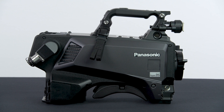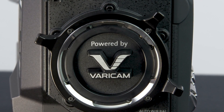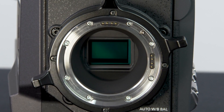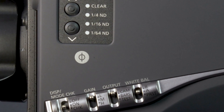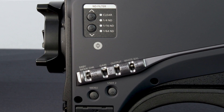It's basically plug-and-play. Starting in the front, we put on a PL mount with a Super 35 sensor. That is a 5.7K dual-native sensor. The dual-native will be active in the fall — right now it's 800 ISO, but we're expecting to have 800 and a targeted 2500. We also have servo ND filters, controlled remotely or locally at the camera head by pressing the button.